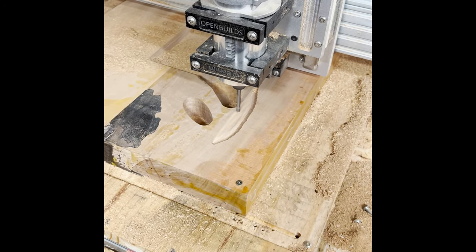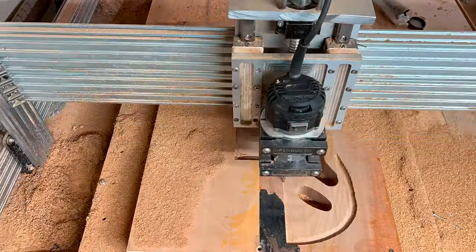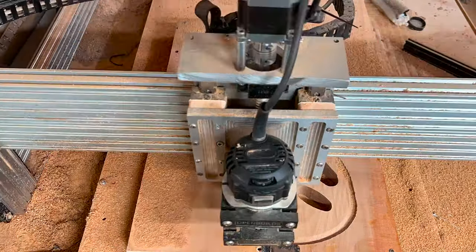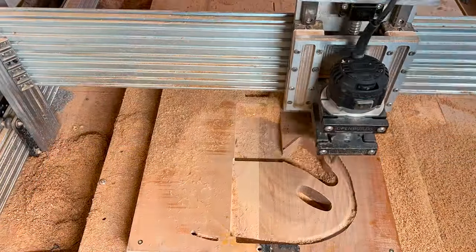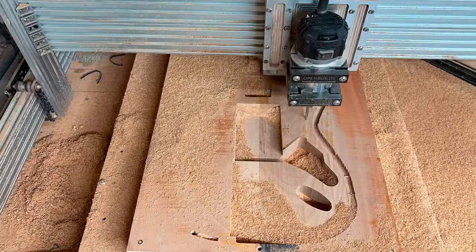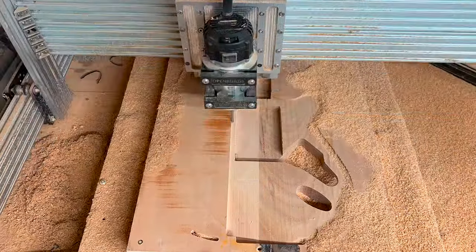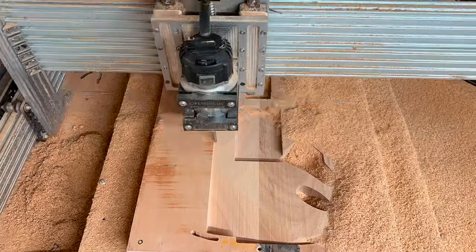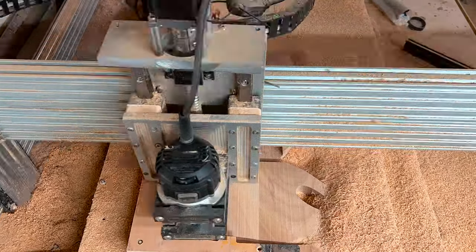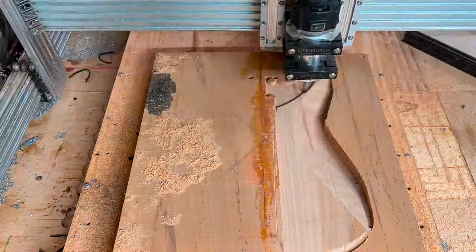Here is the product of our labors — it's just cutting and absolutely destroying material. This is about a 4-6 millimeter depth of cut. In the time lapse it's just chewing through. The surface finish on the guitar is a lot smoother — I was able to do the step-over at about half a millimeter, coming out super smooth. I can now start sanding at 220 grit, whereas previously I'd have to start at 120 grit. The upgraded spindle, added rigidity, and reduced step-over mean so much more capability.